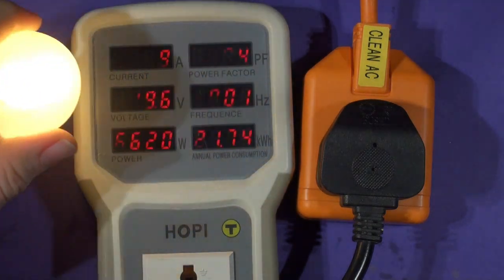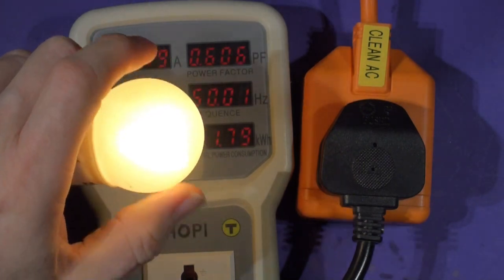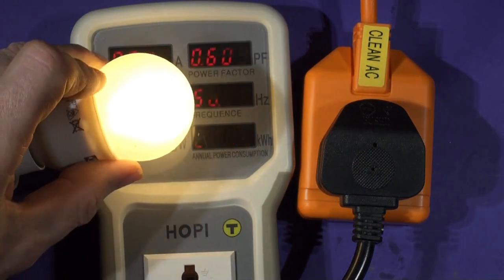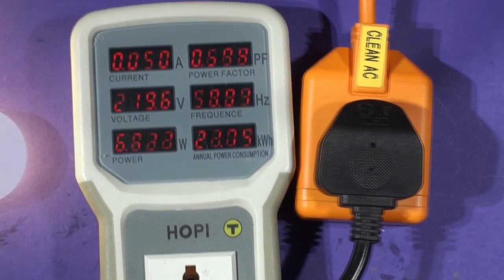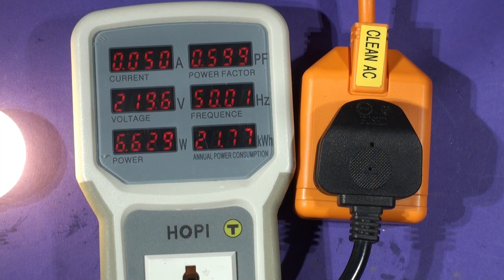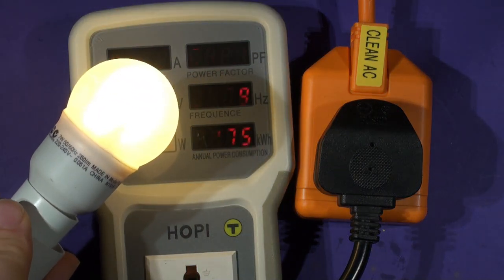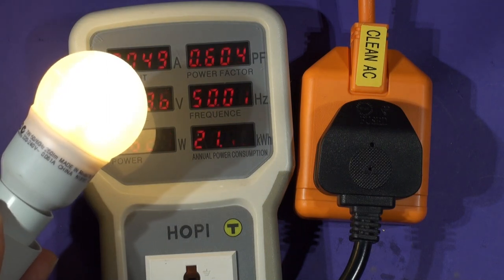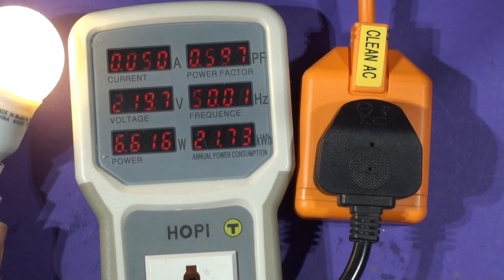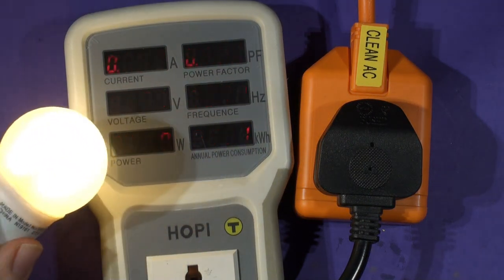You can see it going up: 6.465W, still warming up as heat gets into the electronics, the gas and tubes warm up and conductivity changes. I'll log it at 6.5W after about a minute. Power factor of 0.604 - again an appalling power factor, slightly better than the globe LED with bridge-rectified mains straight into LEDs. The bulb is still creeping up and getting brighter - one of those old bulbs that takes until you've got your pyjamas on before you can see properly.